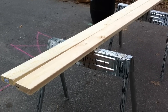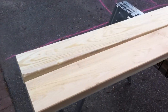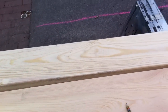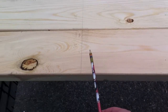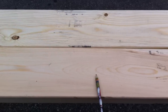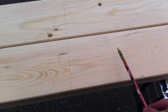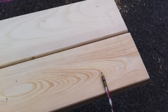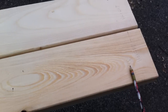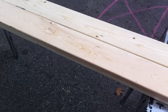The first step is to measure out and mark off where you're going to cut on the board. The measurements I have: the legs are 42 inches total, the crossbar section is 34 inches, and then the height — the arm that's actually going to hold the barrel — is 45 inches, or just the rest of the board. So you really use up these two boards nicely.